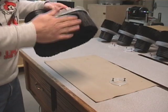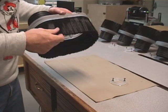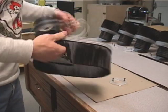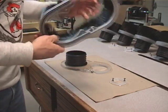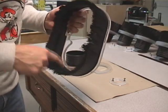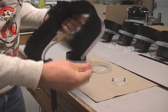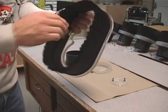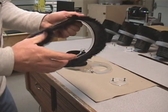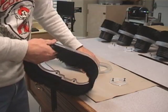It's also a very flexible brush so it squishes down quite nicely and doesn't interfere with Z travel. The problem is when you have that long flexible brush it tends to want to get sucked into the inlet. To help solve that, on the inside there's actually a one-inch length brush mounted on the inside of the three-inch brush around the inlet to your dust collector, which helps keep the long flexible brush from being sucked in.